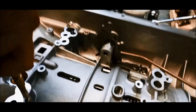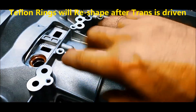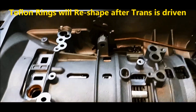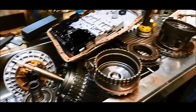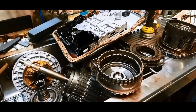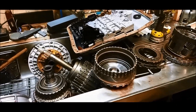That one's probably not sealing 100% on the rings — if you squirt a bit of oil in there it'll actually help seal it up, as air is a lot thinner than oil anyway. That's ready to put the valve body back on there. Don't forget to like and subscribe — any questions or comments leave them in the section below, and throw us a beer if any of this information helps. Thank you for watching.